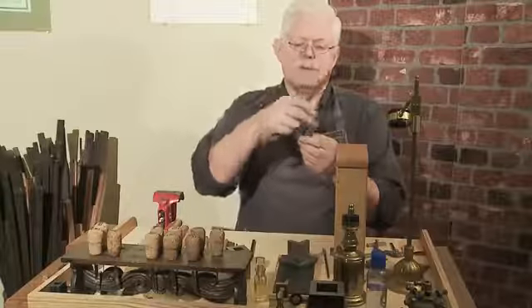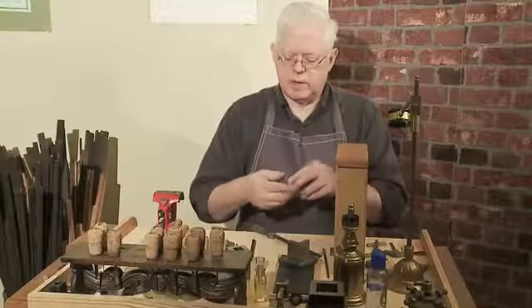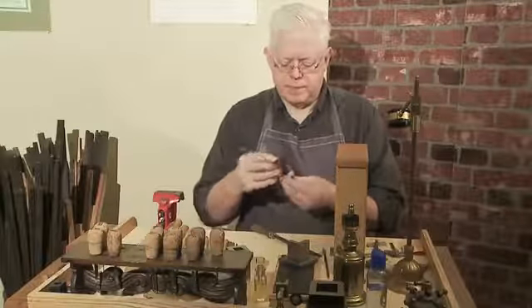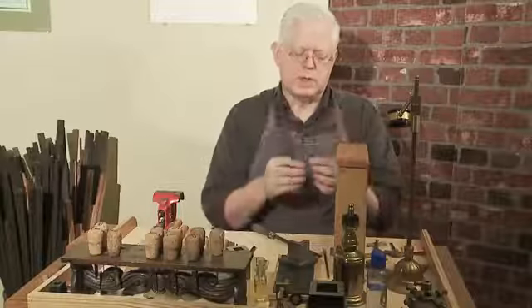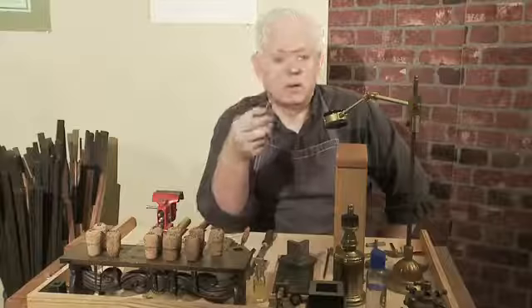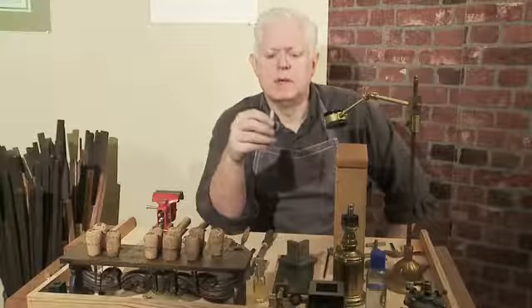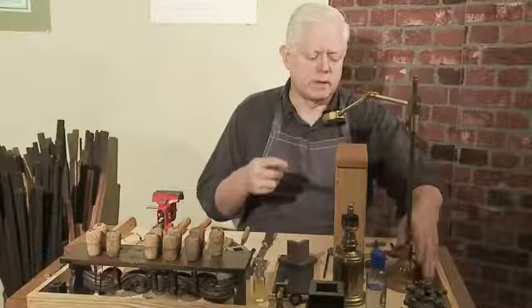Now that I've got the counter and I've drawn the letter, I need to file away these various flats on the side here. I'll make a mark to indicate how far back I should file. After I cut these large surfaces away just to approach the letter, then I'll do the fine filing. So for now we're just doing this very coarse work. I've begun to approach the letter — I've done a lot of rough filing around the outside. It's a long way to go but I've gotten rid of the worst of the excess metal. Now it's a much finer process.